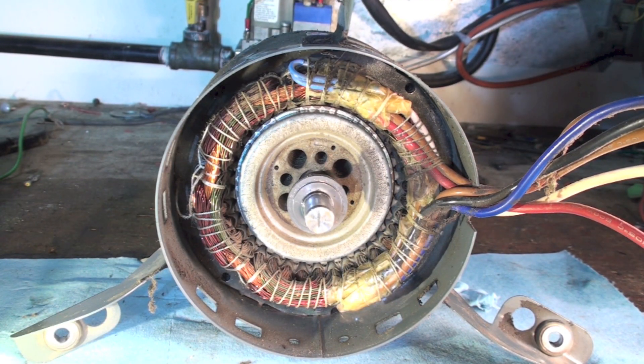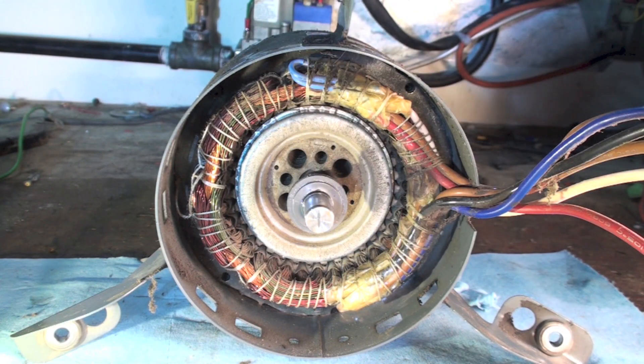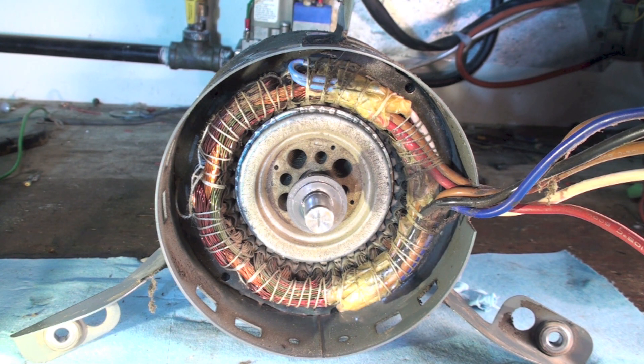In the last video I showed you how the bearing worked on this shaft and this motor. I thought I'd go a little bit farther here — what is going to happen if the bushings fail. A bushing failing could certainly be a lockup from lack of lubrication, it'll lock up and score the shaft, but oftentimes what happens is the bearing just becomes loose.